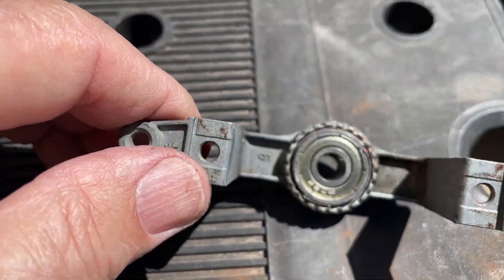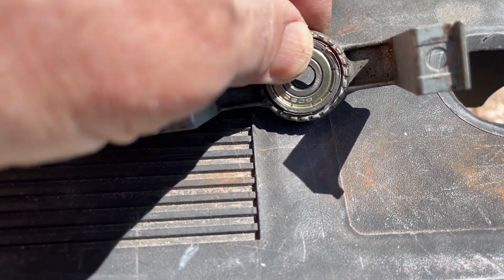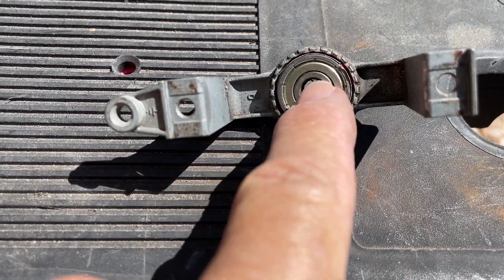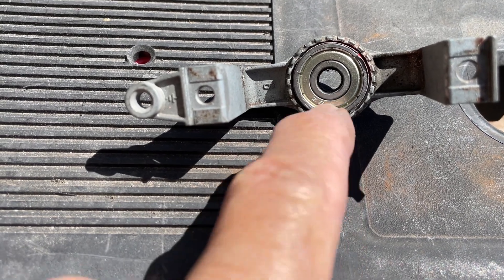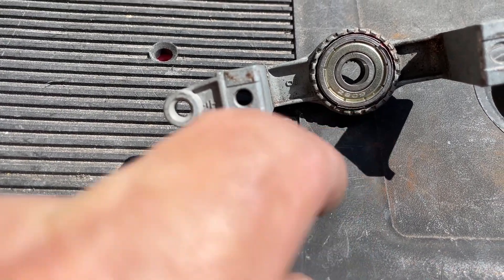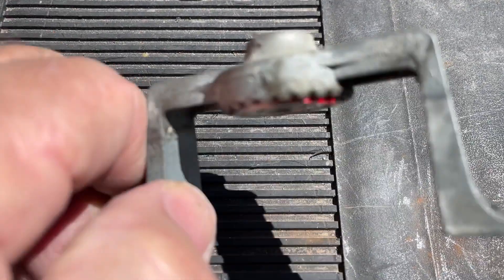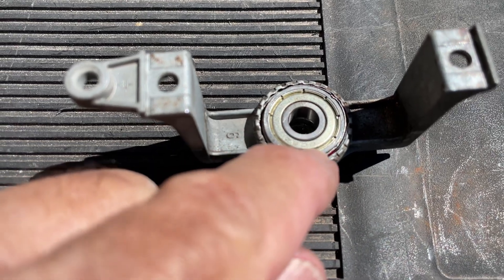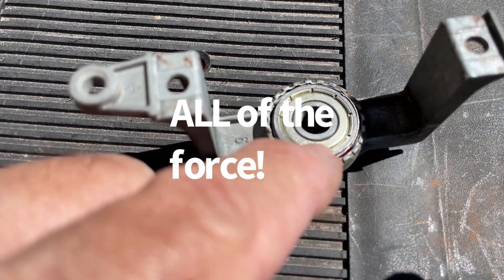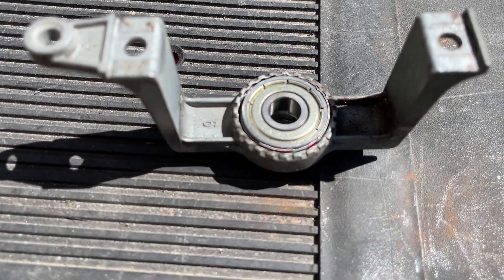There's the shim in place. The bearing is in there, and I can't spin that bearing — I gave it a pretty good wiggle and it won't spin. Now, the only downside to this is driving it on the shaft. When you drive a bearing onto a shaft, you're supposed to put all the force on the inner race, not the outer race. When I go to put this on the shaft, some of the force is going to be transmitted through the outer race. But hopefully it'll go on with just small enough force that I won't damage the bearing.